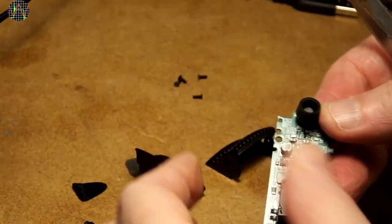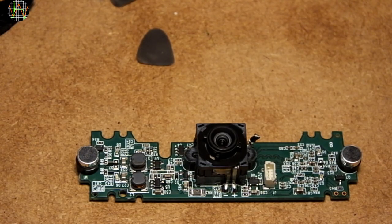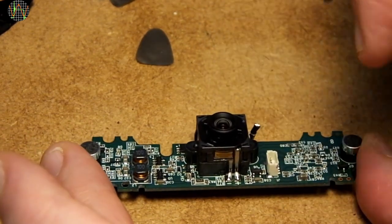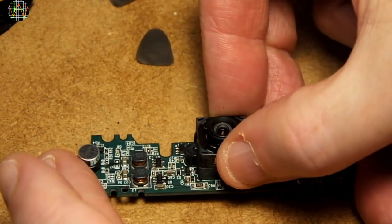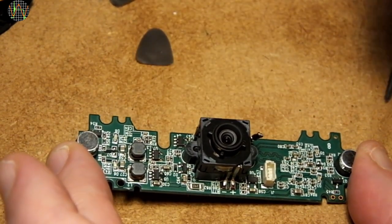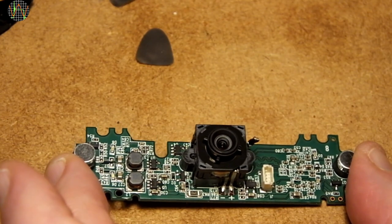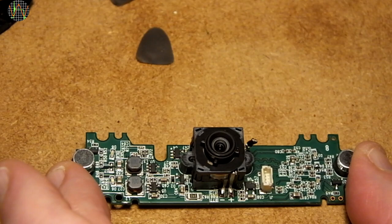And the PCB finally comes out. The instructions are to remove the lens assembly, which provides the autofocus — this means it needs to be desoldered at these two connections here. The other job is to get rid of four SMD LEDs, two on each side. The reason the LEDs have to go is that in the new housing, and with the original lens assembly gone, their light leaks into the CCD sensor.